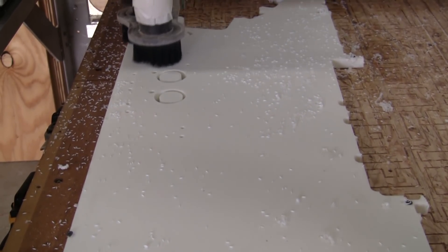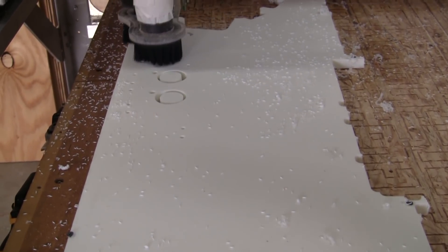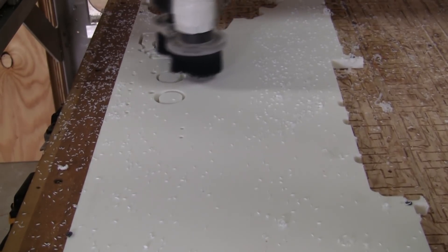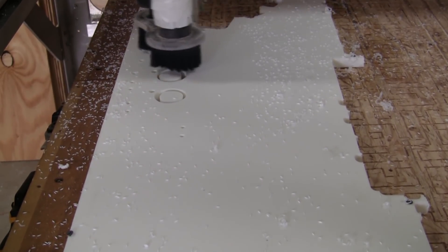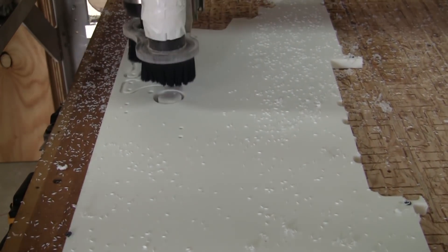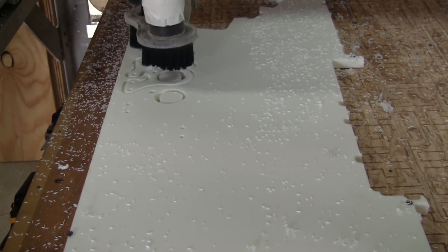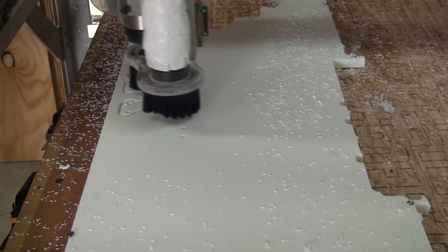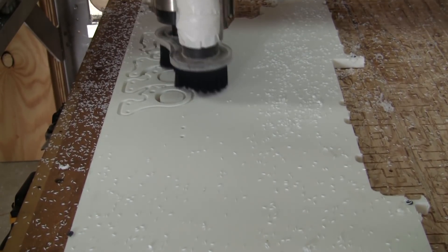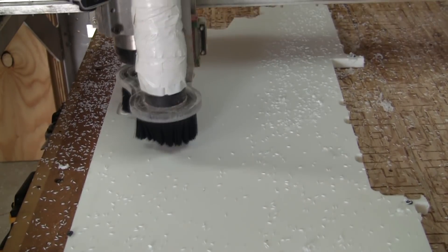On this file, I actually did not put any holding tabs on those first two circles. You can see them shifting around — it was a little iffy. The problem that can happen is the end mill might try to grab into the loose material and jam the machine essentially. That's why we decided to use a profiling operation — because we wanted to have holding tabs. Holding tabs — yes, because drilling doesn't allow you to do that. You can only use holding tabs with profile.